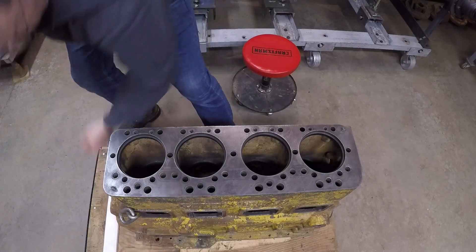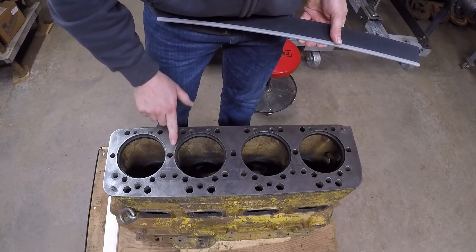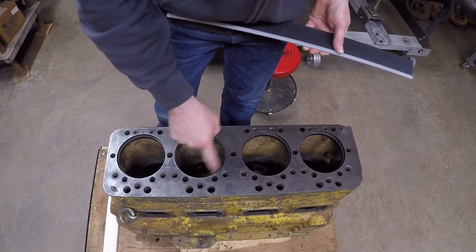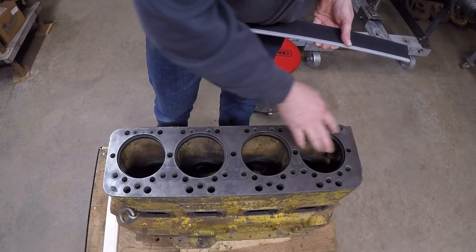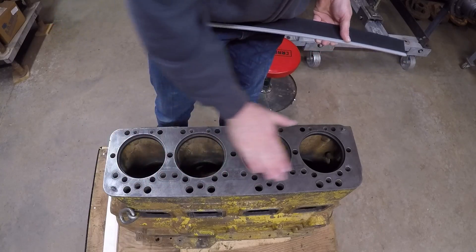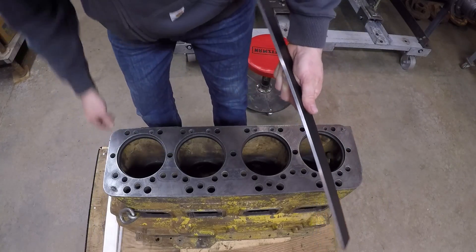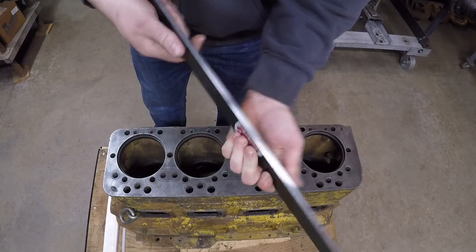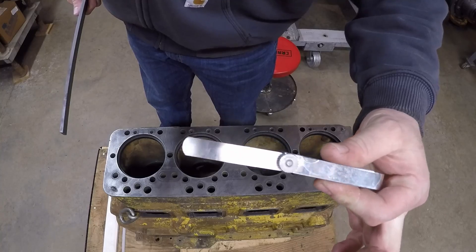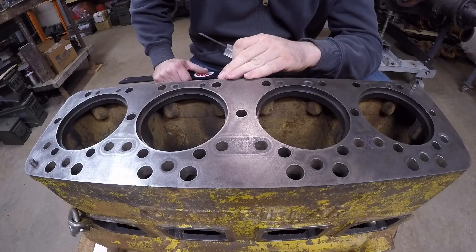There are a few very critical areas to look at, especially on this block. I'm going to really scrutinize the areas between the cylinder bores — you don't want any low spots in here, since the head gasket will seal right on the tops of the new sleeves. I want to make sure we don't have any dips. I've pulled the protector strip off this machined straight edge. It's simple to use in conjunction with the feeler gauge — I've got the five-thousandths thick blade out right now.